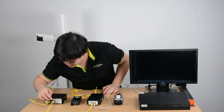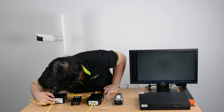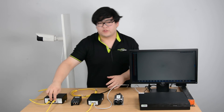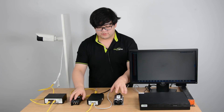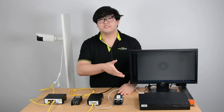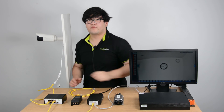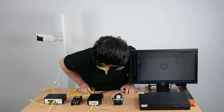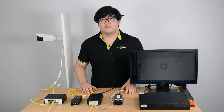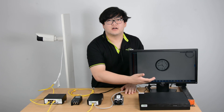Now I'll need to connect the camera to the PoE powered switch. Just a reminder: on the powered switch you have to remember the supply cable goes to port number eight. This is the only one that will receive the power and power up the whole PoE switch. Now let's wait a second for the image to focus. We can see the ticking clock on the wall over there — that's the camera taking the image of it. You can see the clock on the wall clearly; it's ticking.